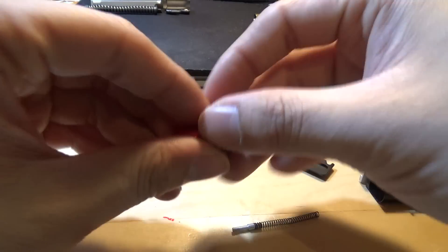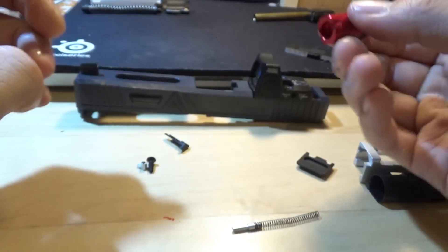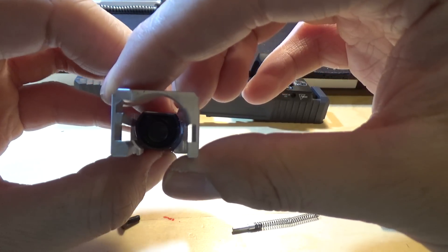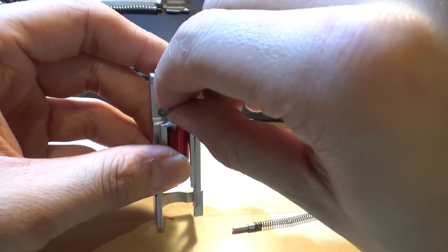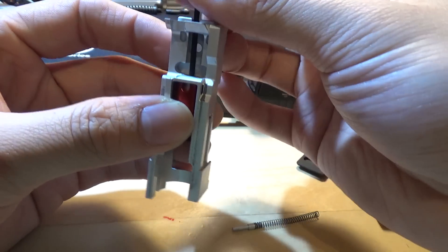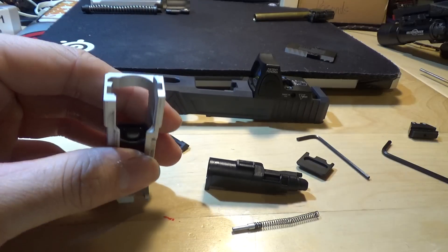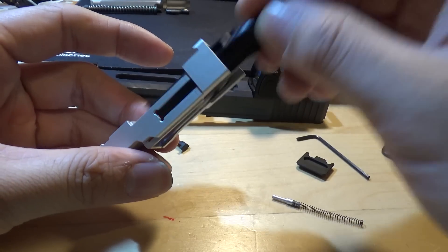For the rest of the key stuff, it's actually very simple. There's one silver screw that goes on top of the piston — this is the piston base. This allows you to install your piston cup. Afterwards, grab this screw. Take your blowback housing unit and install the piston base like so — it should sit in this orientation once properly installed. Put the screw at the back over here and just start torquing down the screw. Make sure your piston base stays still — if it doesn't, you may have to align it. Test if it can move — it appears to move perfectly fine.